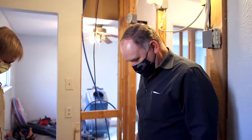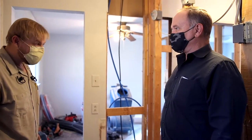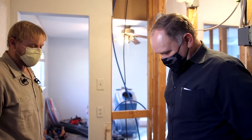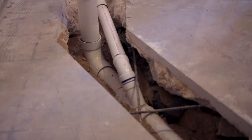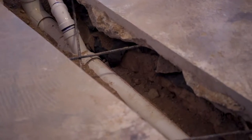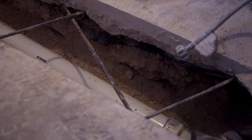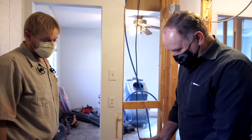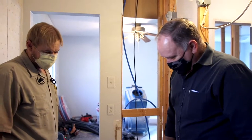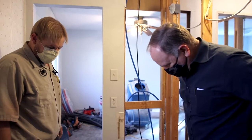Seth, it's looking good. Thank you. I'll sometimes take for granted the things we do as a team, but I think folks appreciate the little details. One of them is my guys didn't have to do any concrete chipping, which makes life so much easier. It's always dug down to the depth I need. The pipe is really deep, and I noticed the detail of what you call shading — putting sand around the pipe. It keeps it really stable.